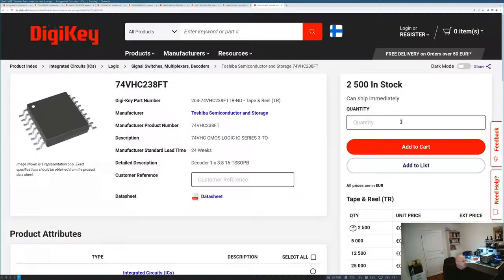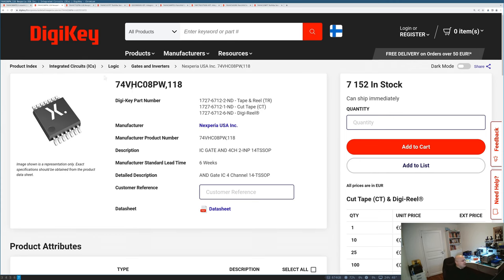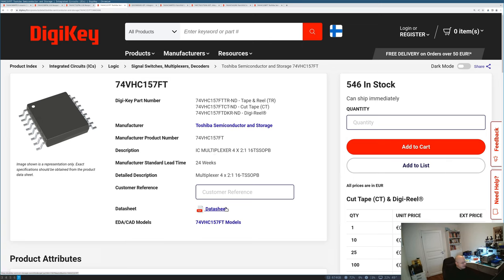But before I go to implement it — what kind of integrated circuits am I going to use? I already made my choice: I'm building my CPU on the 74 series of standard logic ICs. I made a pre-selection of circuits like XOR gates, OR gates, all kinds of gates, plus multiplexers, buffers, transceivers, and more multiplexers.